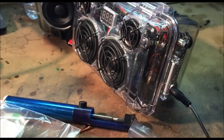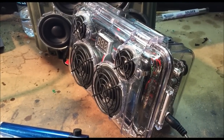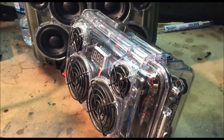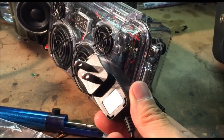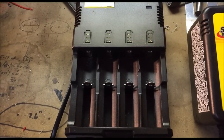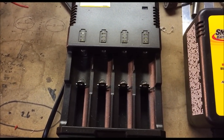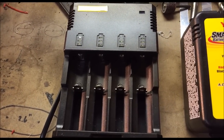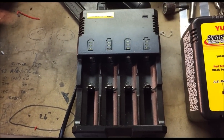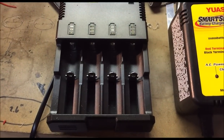With three batteries rated at roughly 3,000 milliamps each, that's 9,000 milliamp-hours combined. At 3.7 volts rated per cell, three in series comes out to a little bit less than 12 volts, but the charger will take it to about 12.5 volts, which is pretty safe. This smart charger — a Nitecore Intellicharger i4, about $20 online — takes each individual cell to 4.2 volts, which is still safe. You certainly don't want to go below about 2.8 volts on lithium ion — they are sensitive. The smart charger is a pretty good way to do it and works really well.